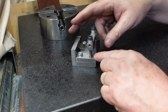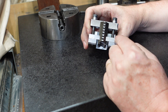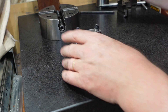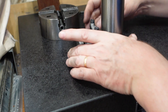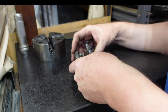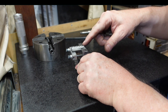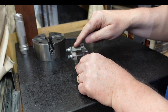The last check I want to do is with this little jig that I've made up. What it's doing is mirroring or mimicking the chuck in that I've got a piece of plate here that I've ground down to very close to size for the slot. That slot should be parallel to this surface, which means that when I put my cylindrical square up there that should give me a right angle. The rest of these are all a little bit out, so I'm going to set that up on the surface grinder and just take a lick off it to get that surface perpendicular.